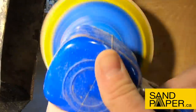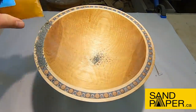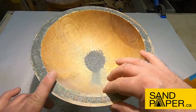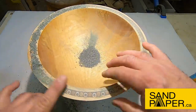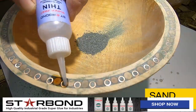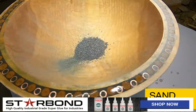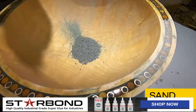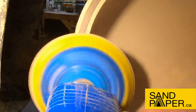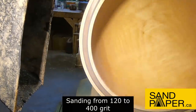It's the next day. I'm cutting this back with 60 grit again. There's really no point in sanding at any higher grit until you get all the inlay filled in here. This is the second filling and the second application of thin CA. Back on the lathe and cut it back again. Just keep doing it until you get all your voids full.